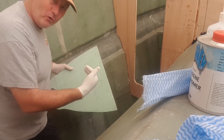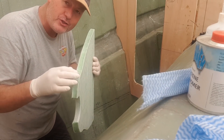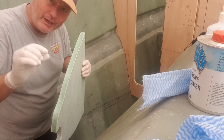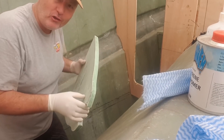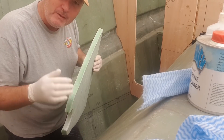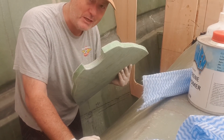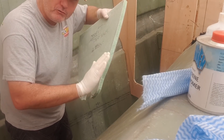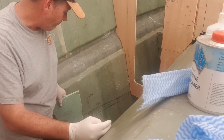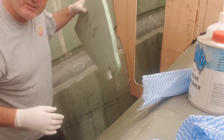This bulkhead is the floor of my forward compartment. What I've done — I've actually coved the foam here. I don't want any sharp points; what I want is a bed of ProBond in between the hull and the bulkhead, and a small gap. You don't ever want it pushing hard against the surface, because that'll create a shear point that could stress and crack the underlying substrate. It's always good to have a small margin, which is then filled with the adhesive, allowing it to spread the surface area out a little bit, and then rely on the tabbing for the strength. All I'm doing here is basically adhering this in place — the physical fibreglassing is what gives the bulkhead strength when in position, not the adhesive so much. So that's going to go straight in place here.